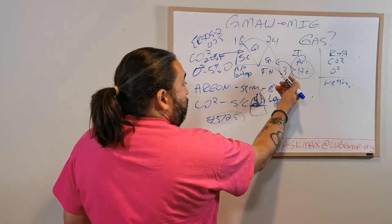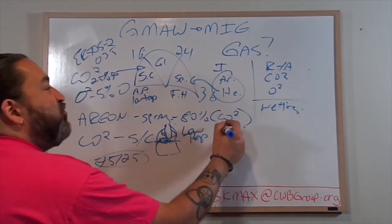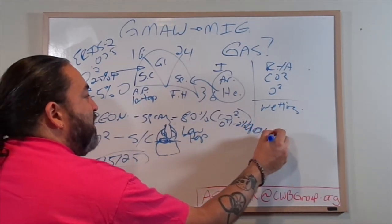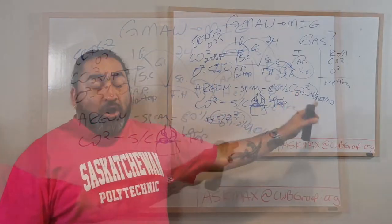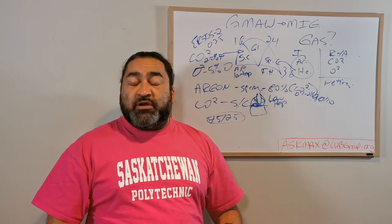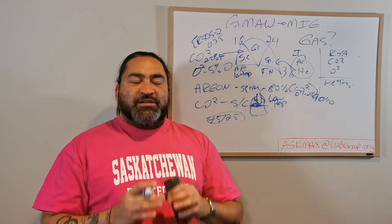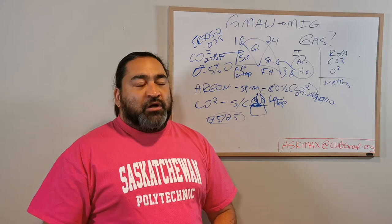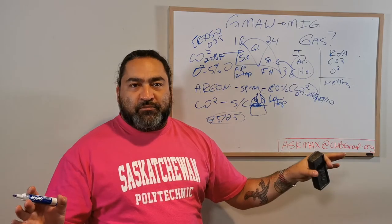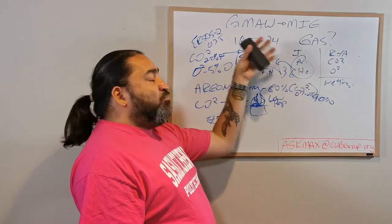Now, in the spray world, we're going to be 80 plus, with the remainder being CO2. Or a small percent of oxygen, 1 to 2%, okay? So often in our shop right now, we're running a 90-10. 90% argon, 10% CO2. Because even at the spray level with the high heat where I could be running a lot of argon or all argon, I do like that wetting of the CO2. It does make for a nice clean edge. It does make for a prettier weld. And if you have the right wire that's got the right amount of deoxidizers to cover the oxygen input, you're golden, okay?